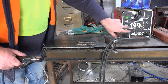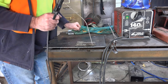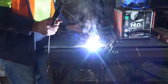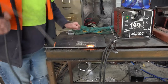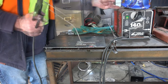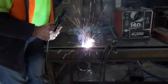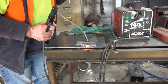I've got it turned up to 140 amp, which is the max on this. I'll try the scratch-match sort of thing — the scratch start. See that guys? A little bit of a scratch and away you go. And also, once your rod has started, it's a lot easier to get it going again. Once you get the thing hot, it's really, really good.